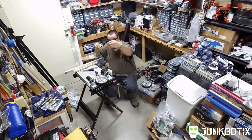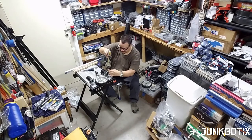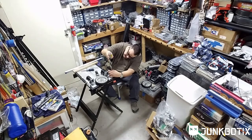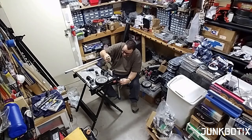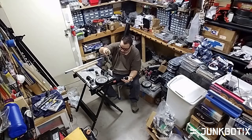If I took my caster and positioned it sitting on top of this bearing block and measured its distance, I find it's about two and three-quarters inches — maybe about a quarter inch less than this. So I just need it raised up about a quarter of an inch. The bearing block is two and three-quarter inches high, and an extra quarter inch brings it to three inches, which is basically how high I need it.